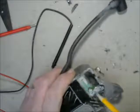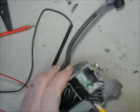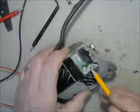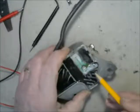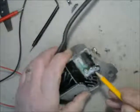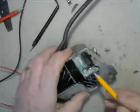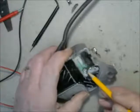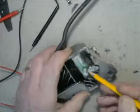I removed a little more of the epoxy so I'd have some room to work in here. I can see the connection where the trigger is connected — it looks a little bit questionable. It's got a large void in one part where the wire is, and that should not be. I'll proceed along here, but if we can't account for a problem we can go back and re-solder that and re-test. So what I need to do is disconnect the capacitor lead by using the saw to cut the copper trace to trim off the portion connected to the capacitor.